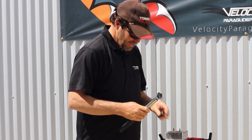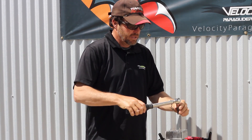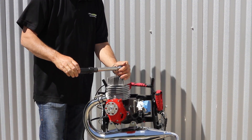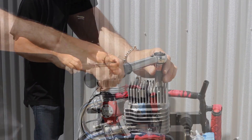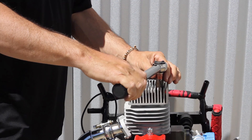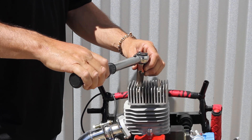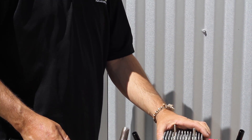The Air Max is 185 inch pounds. Place your 14 millimeter socket on the torque wrench and set it. Place the torque wrench over the nut and pull it until it clicks — you can hear the click and see the lever move; it breaks away and tells you that's good. Do not go past that. This is a new motor already torqued to correct specs, so you may only turn it a quarter to half turn before it clicks.